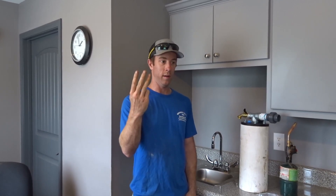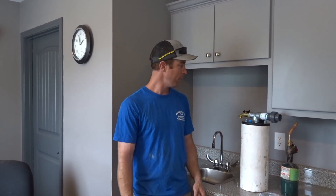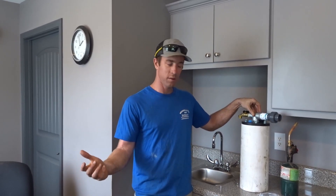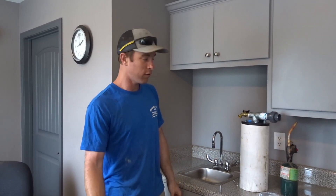Number three — another reason I recommend taking the sample out at the well: you obviously don't want to just crack the spigot and immediately take the sample. You want to let that spigot run for a couple of minutes. Ensure the pump is on and pumping water from your well. It's easier when you're out at the well to tell when the pump kicks on than when you're inside the house. So that's another reason to take the sample out at the well — ensure your pump is delivering water from your well.